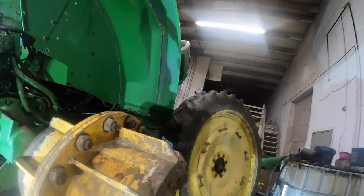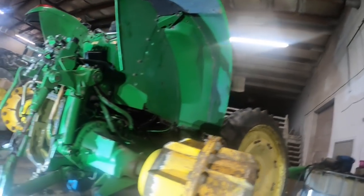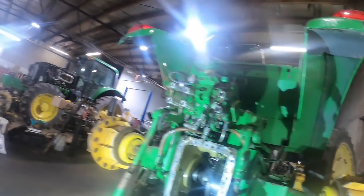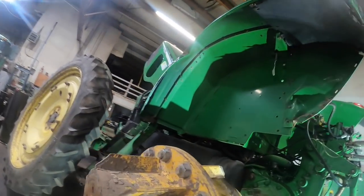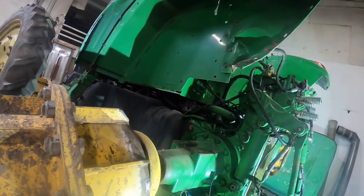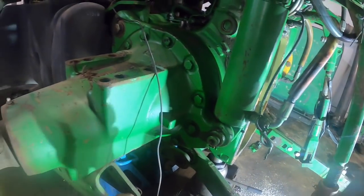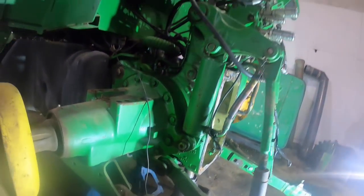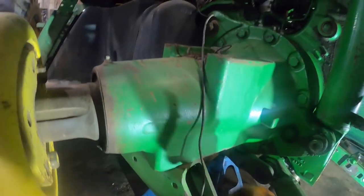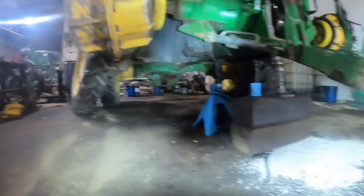We're plugging along here. I got the wheels off — I think there's calcium in those skinny tires, man, they're heavy. These are loose. You've got to get two big six-inch three-quarter-inch drive extensions and a three-quarter impact and go clear up in here the length of this to get these bolts out — it's heavy, just kind of hanging on the axle right now. I'm going to go ahead and get these stabilizers for the draft arms off. Pretty simple on this one — the other one doesn't have that kind of pan in it.